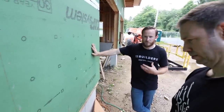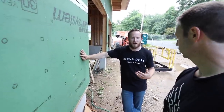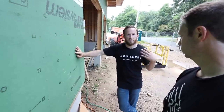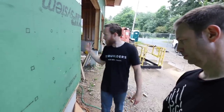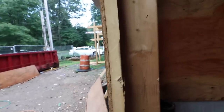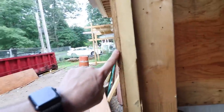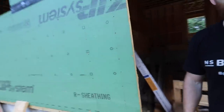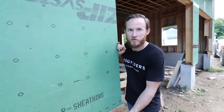From there I saw not faults but areas for improvement — like here, we have basically an inch and a half of foam. Overall we've got two inches. You haven't trimmed this one yet, correct. So this is R9, and this is polyiso — so you get an inch and a half polyiso bonded to a half inch shear sheathing. When we came down to our foundation, we're dealing with open polyiso, so I reached out to Steve, a friend who's an architect.